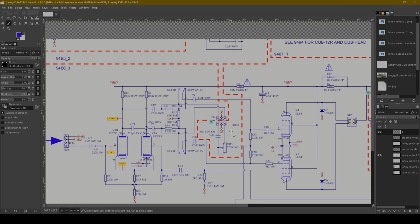The only other comment I do really want to make, though, is right in here. Now, one of the mysteries I was trying to figure out is what exactly are the inputs. Like, you've got the 1 watt input, and I think what it's doing is you've got this VR3, and the way this is set up is like a Type 2 post phase inverter master volume.